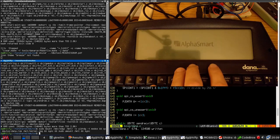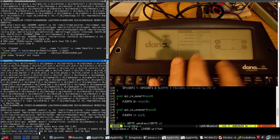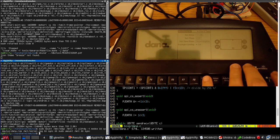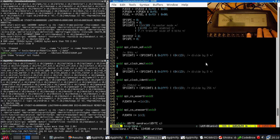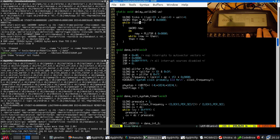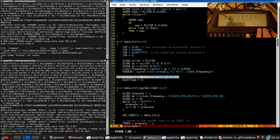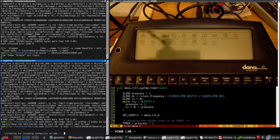So clearly, when I ran CoreMark, it overwrote some of the magic numbers that let PalmOS know whether the RAM is consistent. So it went through the full reset procedure. Currently, I actually have this set to only use 4 megabytes of RAM because my reset script only seems to produce that much available. I think I could probably bump that to 8 meg if we're running from PalmOS, because PalmOS has configured it. And of course, now that it's reset, I don't have Dana run anymore.